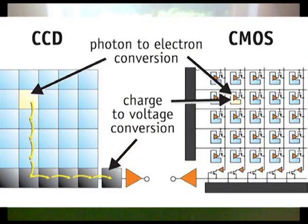The main difference between CCD and CMOS is that CCD sensors process all the light on the side of the sensor chip, as opposed to CMOS which have many little transistors beside each pixel. This means that CMOS cameras often have a lower brightness sensitivity, as the transistors get in the way and block out some of the light.